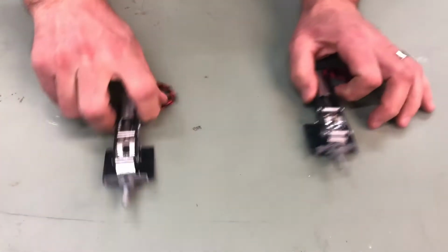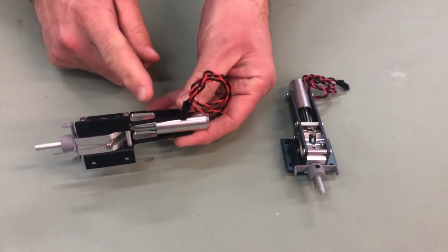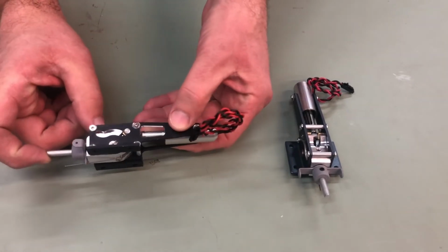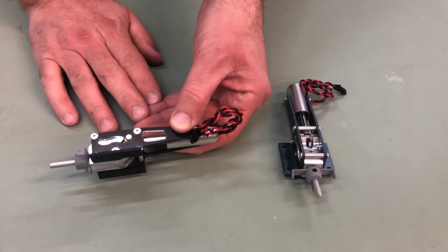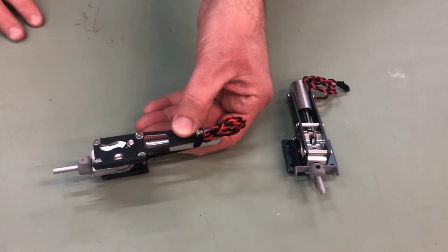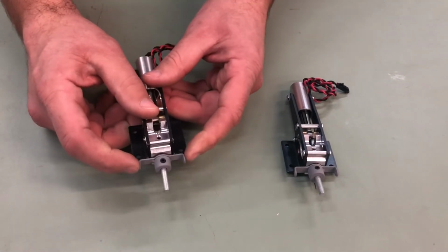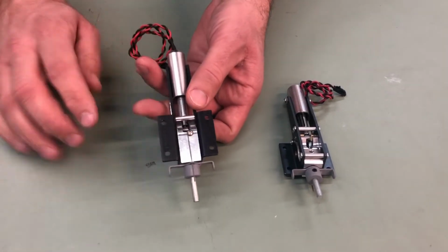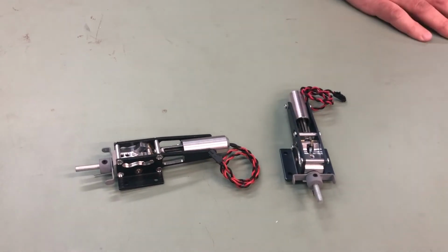And like we did say, this is a reverse gear. So the retract, when it comes up to retract, will actually be away from the actuator. These are available in pneumatic or in electric. The pneumatic is an air up, air down. Has pull steering on the tiller here and your centering spring. We'll go ahead and operate this so you can see what we're talking about.